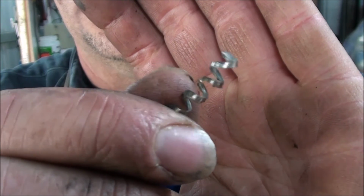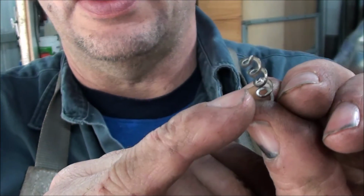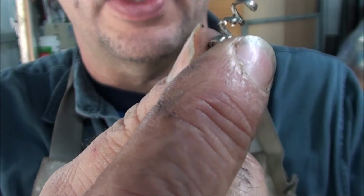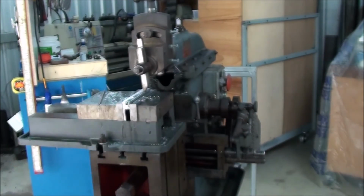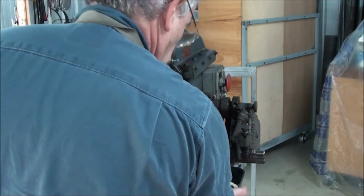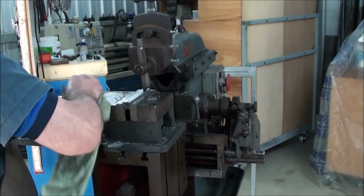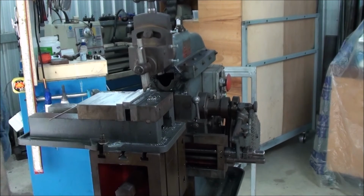Chips that have come off it when it's cutting in that direction. As you can see, it's a nice chip. There's a little bit of yellow to it, a little bit of yellow, no blue, so that's a pretty good production chip for a shaper. So now we're going to start chasing sizes. I'll be back in a sec.